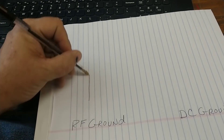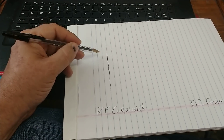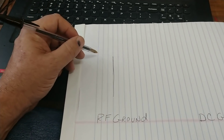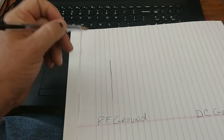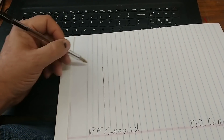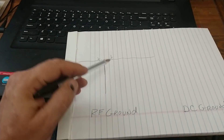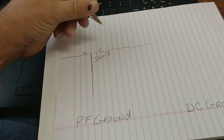So you've got a piece of coax. Say you're direct feeding a half wave dipole. You've got some number 12 stranded wire — could be solid too, but stranded insulated works really well. Cut to electrical length of a half wave, whatever frequency you're wanting to operate on. You've got the center conductor connected to one leg, your shield connected to the other leg, and these are equal length. In this situation, this is your counterpoise — your shield — this is your RF ground.